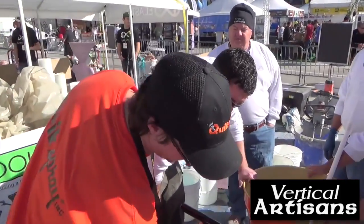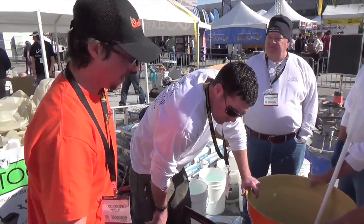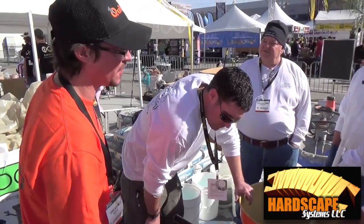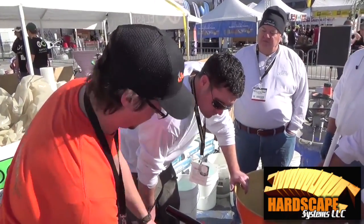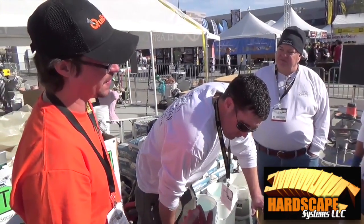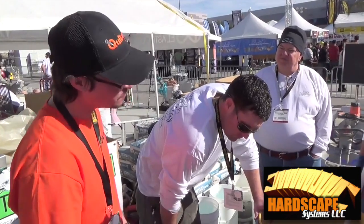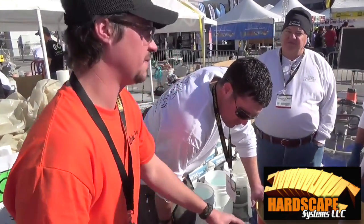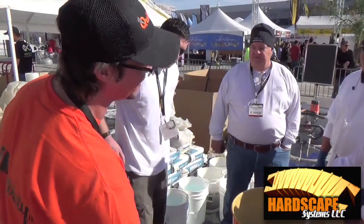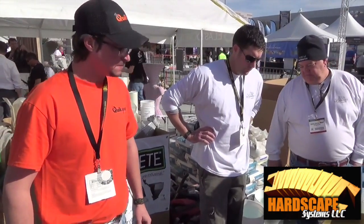The biggest deal that'll happen is sometimes you get some water in here, so then maybe you want to dump it out. But the big thing is if this thing will sit for a month or something when you're not using it, you want to make sure that the motor is properly lubricated so you don't have extra moisture in there, so you don't get a little bit of rust build up, and then the motor will seize. Fixing that problem isn't a big deal. You just don't want to have to fix it. So you just want to make sure that there's no extra water in the system. You can always take this off, shoot a little WD-40 or something in there, if it's sitting. Other than that, easy peasy.